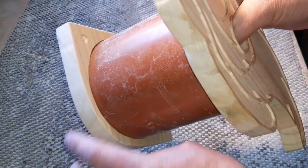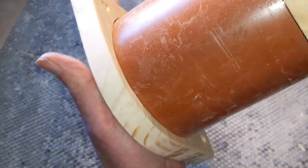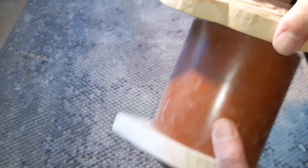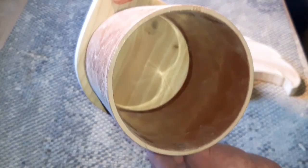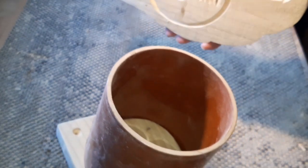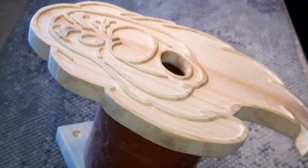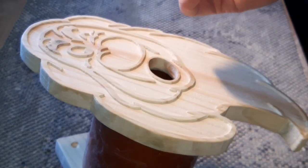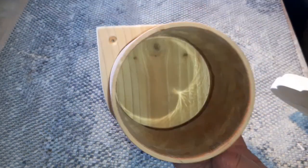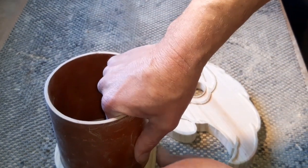But I've noticed here with those two screw holes, one at the top and one at the bottom, obviously that will fasten to the post. We're not going to get in with screwdrivers or anything. So the idea is we'll fasten that to the post first, as it is, make it all nice and secure, and then we'll come along and slot the front piece on afterwards. And then, like I just said, should you need to clean it out, or there's some bees or wasps have moved in, we can just remove the screw from either side and take that front piece off, and that will be left on the fence. You'll see towards the end of the video as we put it all together.